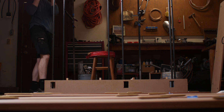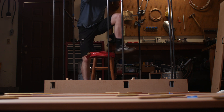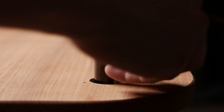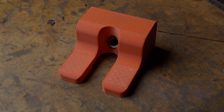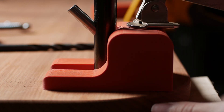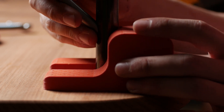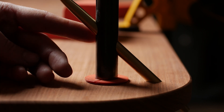So, shocker — we're going to rely on an overly complicated jig. Although this time I used a combination of CNC parts and 3D printed parts. I have a set of boxes that will hold both the shelves and legs into position. That taper on the bottom of the shelves is definitely making my life harder here, but I still like it. The real trick is the 3D print has a hardened drill bushing pressed into it. That, coupled with an alignment pin, ensures the holes are spot on. Once everything is clamped and triple checked, we can drill and ream the holes to final size. After that, we just hammer the pins home and remove the alignment bushings.